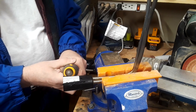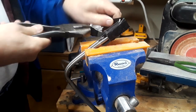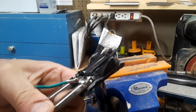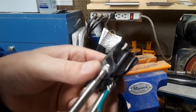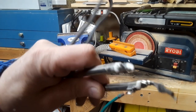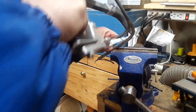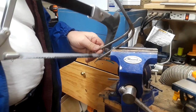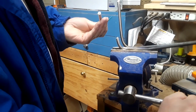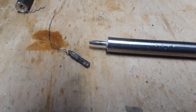Before I get started I thought you might want to join me for an autopsy in progress. Far from being a delicate piece of electronics, I'm a little curious as to why the charcoal starter still worked even after squishing and mangling it to get it into the tube. Inside of the tube on both ends is a small threaded rod and a nut to attach the electrical cord to. As I cut further up the tube I found that the entire tube is filled with a white insulation, and there's a threaded rod about 6 inches long on each end made of steel. At the other end of the rod is where the coiled nichrome wire begins, and that's about all there is to it.